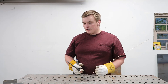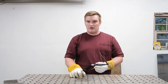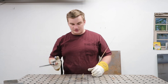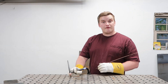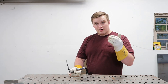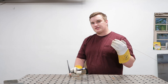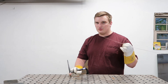What I want you guys to do is set up some little coupons — maybe tack together a T-joint or butt joint to start with. We're going to assume our materials are the same thickness, so we're going to hold our torch at a 45-degree angle right in between our 90-degree joint. Then with our rod hand — the welder is completely turned off — we're going to start feeding our rod and counting one two three.